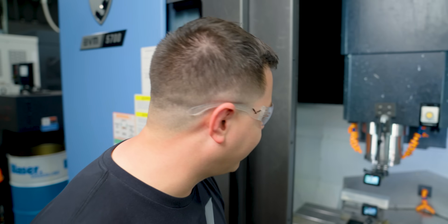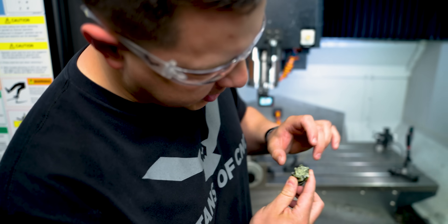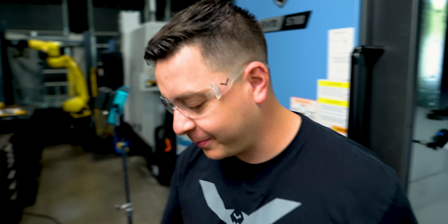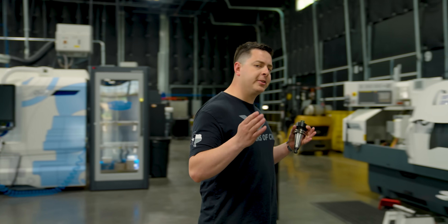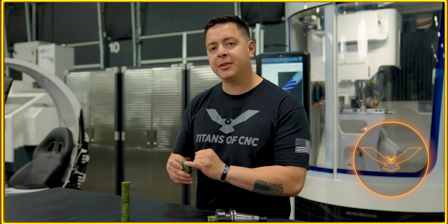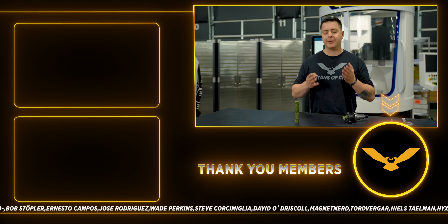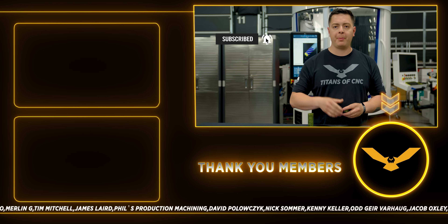It went further than I thought it would — I'm impressed. There's no cutting edge left on it, but look at that — that's what jade looks like on the inside. That was a great experiment, and even though it's not 100% Barry-proof, we actually learned a lot along the way. The tool geometry that helped us: we created a six flute jade end mill rather than a four flute glass end mill, put a K-Land on the outside cutting diameter, and created a notch for clearance. All of this together created a successful end mill that was able to cut wood and plastic, and almost aluminum. This is going right up on CNC Expert — if you like what we're doing, ring that notification bell, like, comment, and subscribe. We'll see you on the next one.